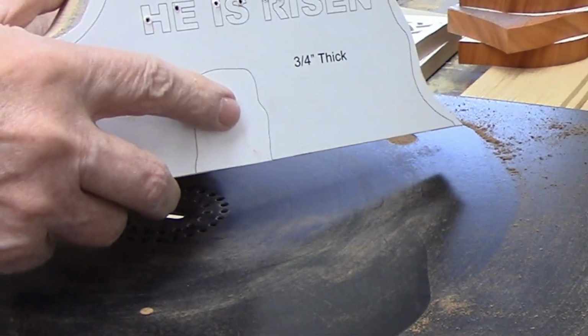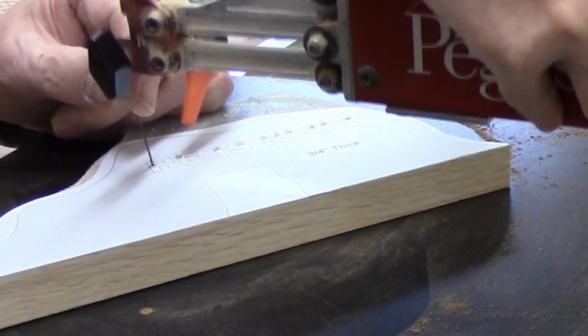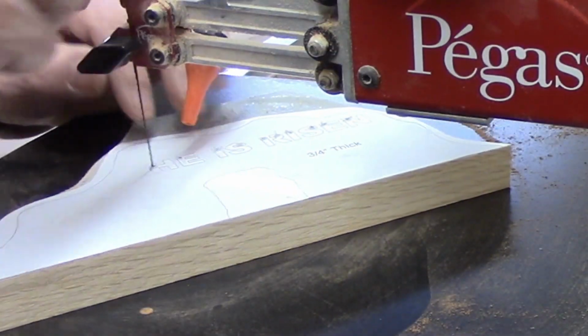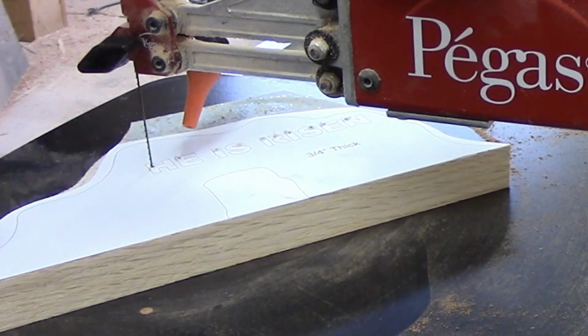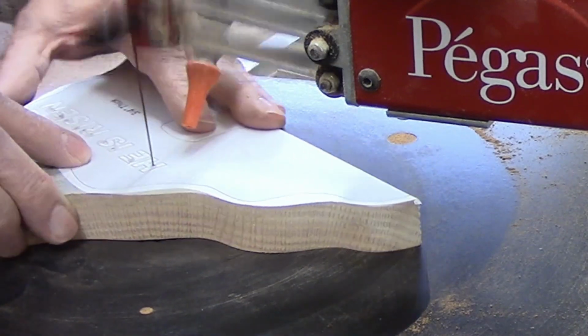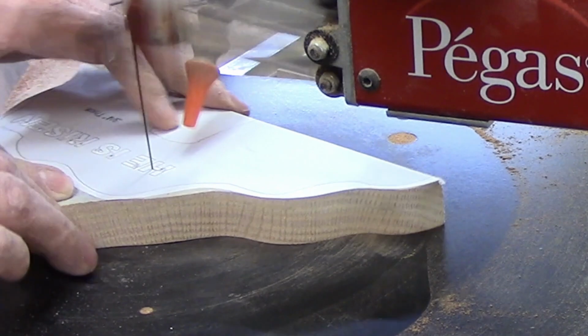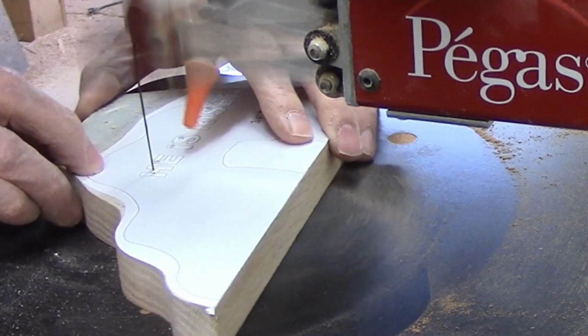This is 3/4 inch red oak, and my experience tells me to use a number 9 blade for these cuts. If you're new to scroll sawing and still unsure about what size blade to use for a particular project, I'll leave a link on the screen and in the description to my video on how to choose the right size blade for the task.